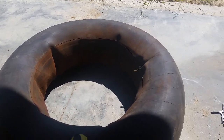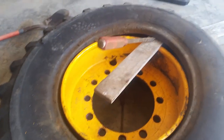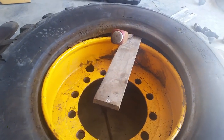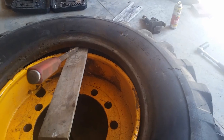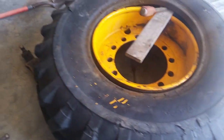I have no idea how long that's been in there. I know it didn't come with inner tubes originally, and the O-ring was missing, so probably somebody before me ended up putting the inner tube in. I am going to order one for this machine - the tires are 17-and-a-half by 25, so it's a 25-inch rim. It's going to be hell getting the new inner tube in. I was able to pry it up with a couple of boards to sneak the inner tube out. When I put it back together, I'll try to get the valve core in through this hole here.